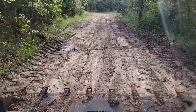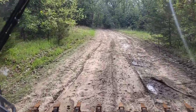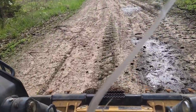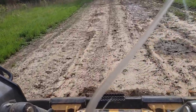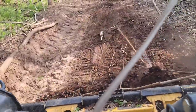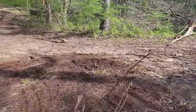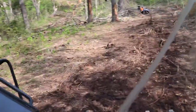We're just going to go through here — this pounding rain really helps settle this road quite a bit. We'll take the bucket and come through here last, kind of slick this up, just kind of even everything out to where it looks good. We'll just drop down right here, kind of skim along, just knock that whip off. It all comes down to getting ready for seed prep — just no ruts, just clean all the debris out. Now these roads are already in pretty good shape because whenever we drag over them, we try to blade them out pretty good with the skidder.